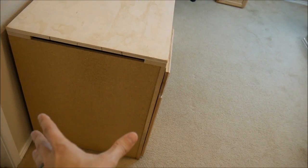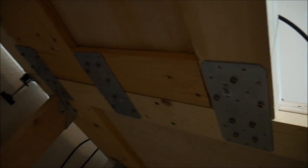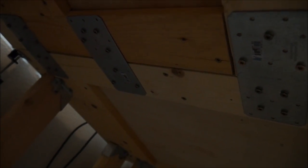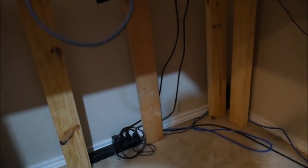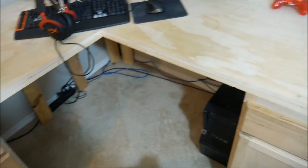There will be a veneered piece that you kind of glue on and stain. I also had to laminate the two pieces together with some metal brackets so there wouldn't be a buckle where those two pieces met. I also put some 2x4 supports in the back because my son really wanted a corner desk, and I knew there would need to be some support there.